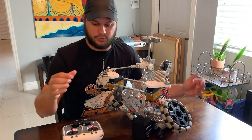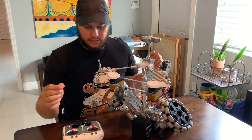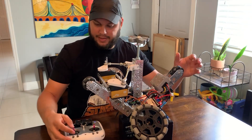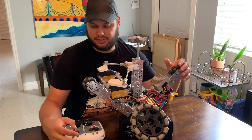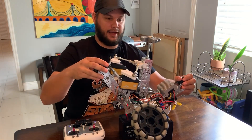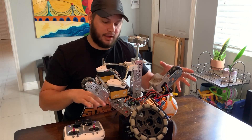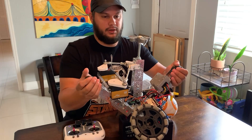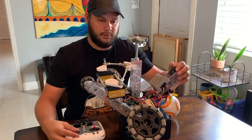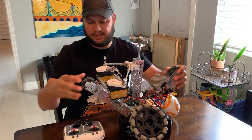What the V-tail setting does is communicate with the servos so that when you press forward, it knows to move both servos in the same direction — and the same for back, left, and right. There's a switch now — I'll turn this sideways so you can see — and if I switch it on, it's going to switch on stabilization. That way, if BB-8 leans forward, his head goes back; if it leans back, it goes forward; and the same for left and right. You can see it's working to keep things straight up, so if there's rocking it will hopefully keep the head straight — and the same goes for side to side.